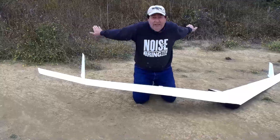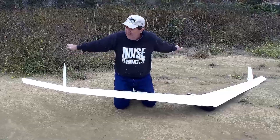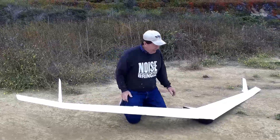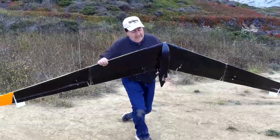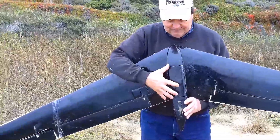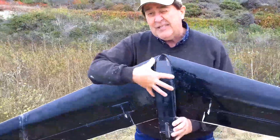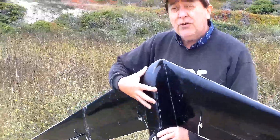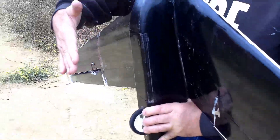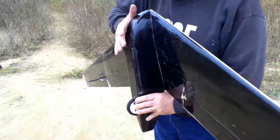When you're taking off with a flying wing, your wing is behind you, and as you round over the hill you have a tendency to hit the wingtips on the hill. By having the tips angled up, that will help clear bushes and so forth in that type of situation. You'll notice that I have a center section pod here that is aerodynamically representative of the actual pod that'll hold the pilot. The wheel is actually quarter-scale. This pod area is only half the size of what the final configuration will be — it'll be twice as big and twice as wide. So this is not in scale to the aircraft, but it was appropriate for the model.